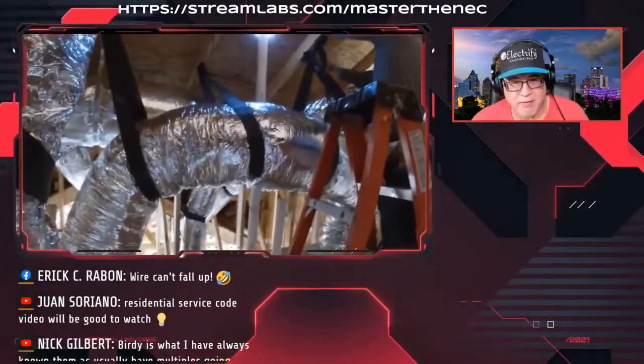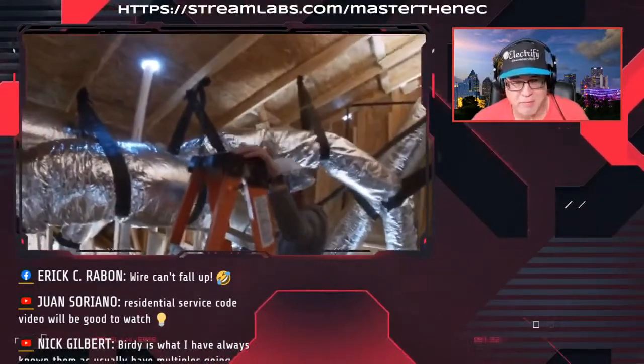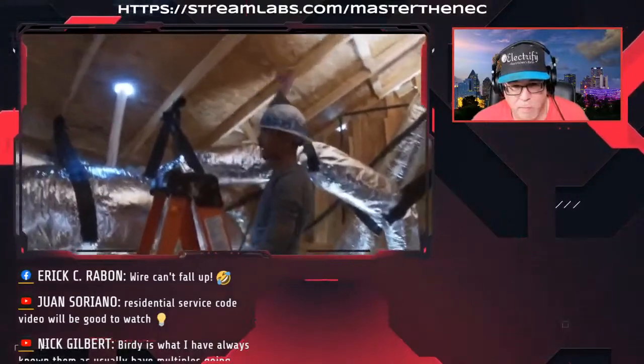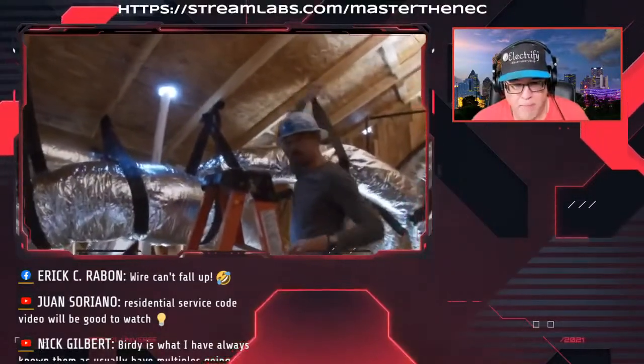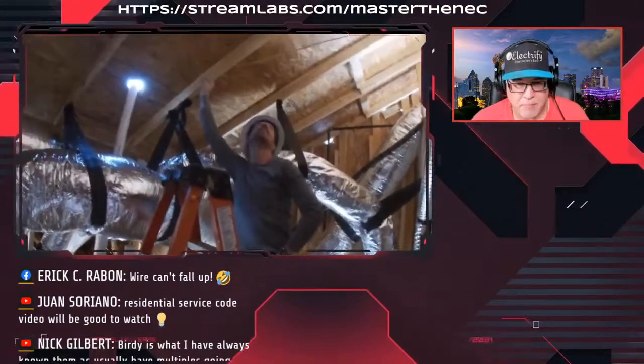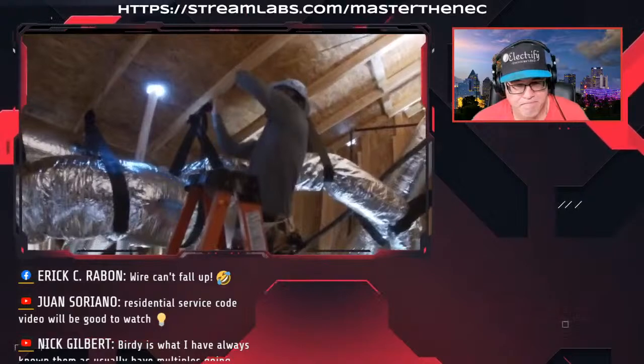Ooh, they need to get that boot on that vent, just before it rains, you know. So this wire is going to get hooked to this unit. And I have to put a switch in here that works as a disconnect. It's like a gas unit. For now, as long as I've got it here, it's good.